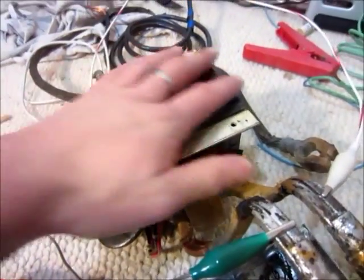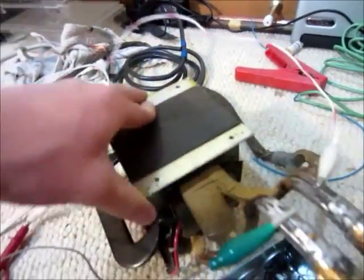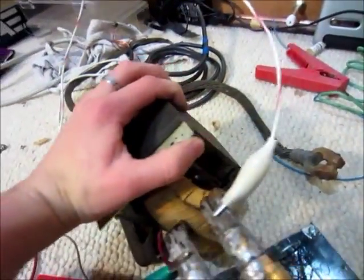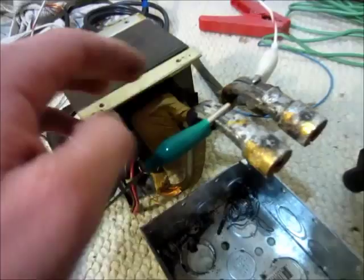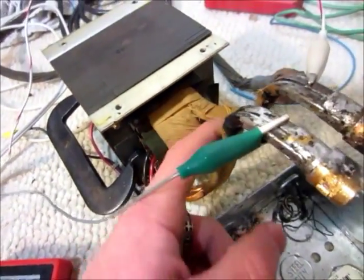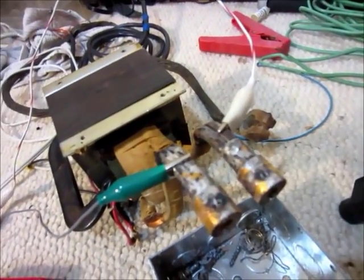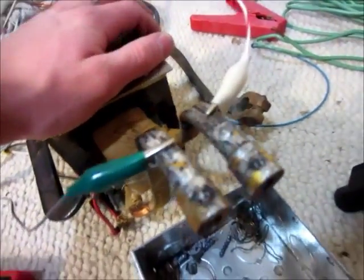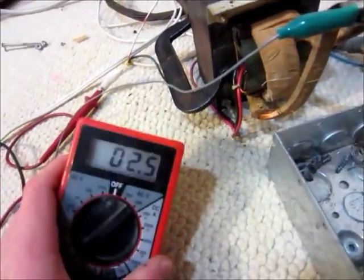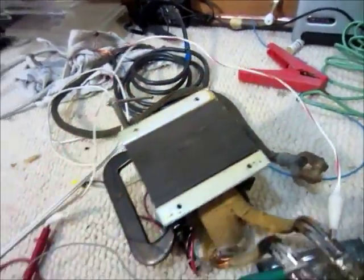Hello, this is MicroJM1, and here's that big transformer that I got. It's about the size of a microwave transformer, but it's pretty big. It's got three turns of this wire — I wouldn't even call it wire, I'd call it bus bar or something like that. The max output is about 1,150 amps at 2.5 volts, and the input is 120 volts AC.